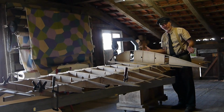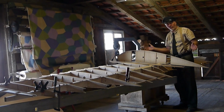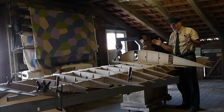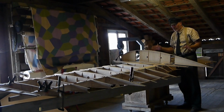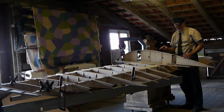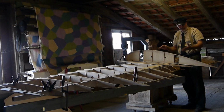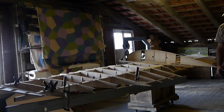That means once the ribs are adjusted in the system and glued to the wing spars, the aerodynamic inclination of the wing towards the wingtip is generated automatically and nobody can do anything wrong. That's a simplification of mass production others only can dream of. Fokker and Junkers both did it that way, and once you've understood that, you realize how simple it is to actually build a Fokker aircraft. Those two, Fokker and Junkers again, way ahead of their time.